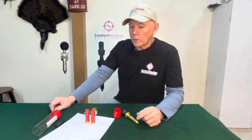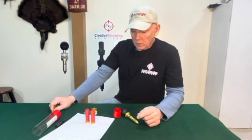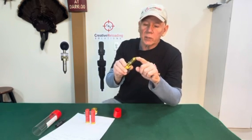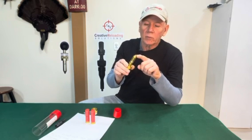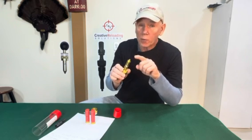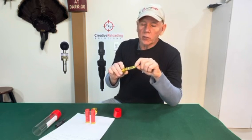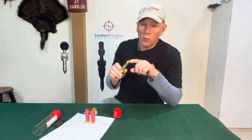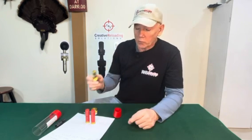I mean, there's a couple reasons that I would shy away from trimming primed shells. The first reason is you would have to take off this little pilot tip that I have on the trimmer there. You would have to remove that little roll pin, which we press fit in there so that they don't fall out. And they're just the son of a gun to get out of there. I mean, I've had a couple that I couldn't get out that they broke off, and that's a bad day if they break off inside the trimmer.